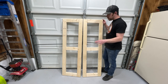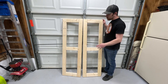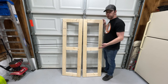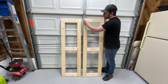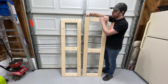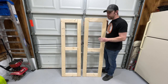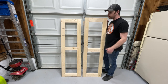I've got the top and bottom done with the added middle supports — two more 11-inch pieces. Next are the corner supports, which will tie both frames together. Your typical bar height is 40 to 42 inches; I'm going with 42 inches. Two-by-fours are an inch and a half thick, so accounting for both the top and bottom frames, I subtract three inches — giving me 39-inch corner pieces. 39 inches plus three inches equals our 42-inch bar height, plus three-quarters of an inch for the tabletop.